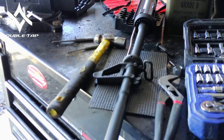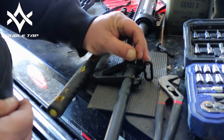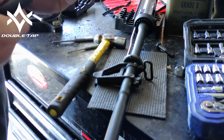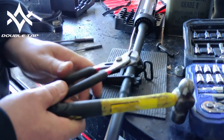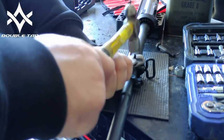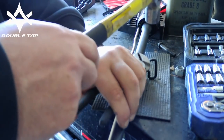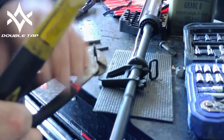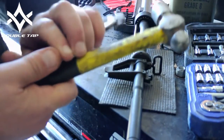I've already managed to remove the first pin, and the second pin was being stubborn. About that time my camera shut off because it went into standby mode. I've got this one rounded off because these things suck. I'm trying to use the old pin to knock the new pin out to avoid destroying my punches. These pins have never been taken out before — they're flared on both sides, and they're never really intended to come out easily.